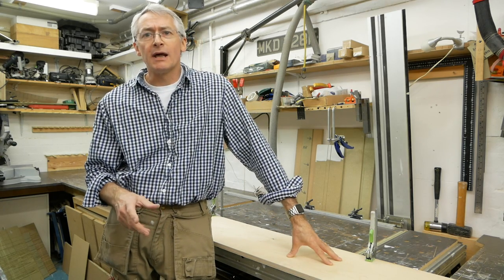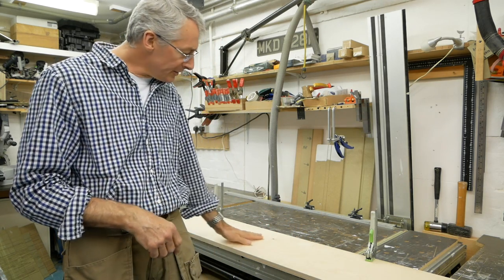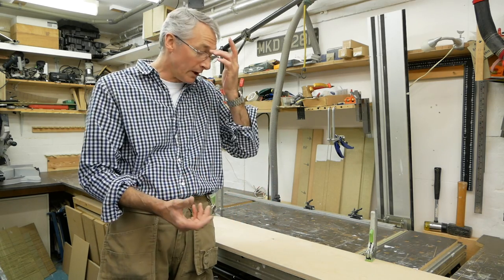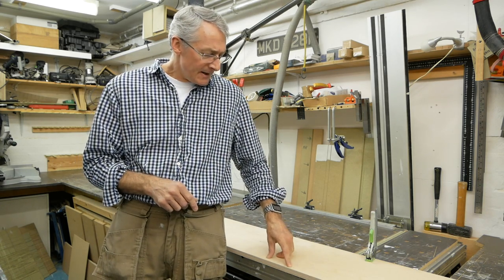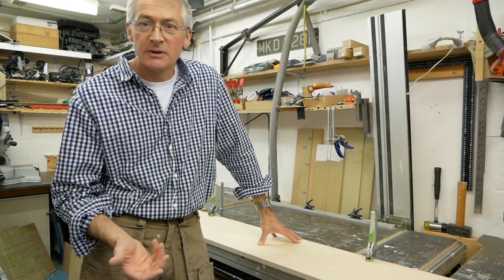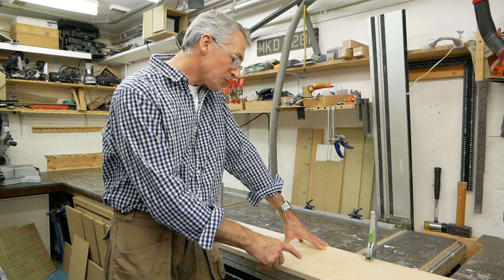When I cut the notches out of the template, I just did that with a hand saw and a coping saw and finished it off with a chisel to get it nice and clean. But for cutting the notches out of the actual shelves I've been agonising a little bit as to what's the best approach. This is the finished material so you want it to look quite nice — you need a good clean cut. I could enlarge the notches in the template a little bit and cut them out with a flush trimming bit, a template bit with the bearing guide. But then because you've got the corner, you're either going to finish the corners by hand or just accept that it's going to be a little bit wider and deeper than perhaps you might want. You could do it by hand with a coping saw, but that's a lot of work.